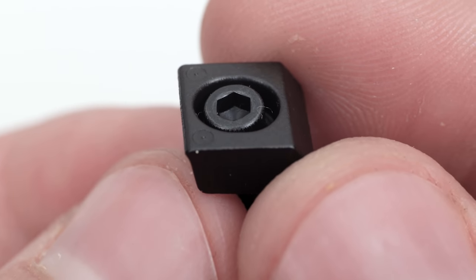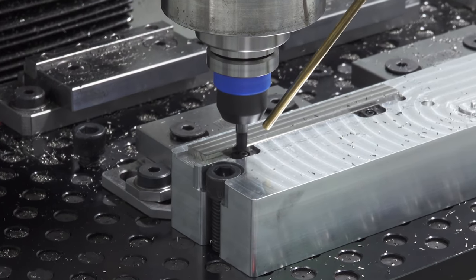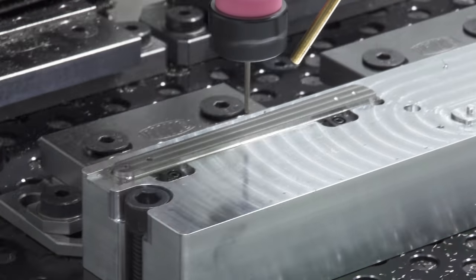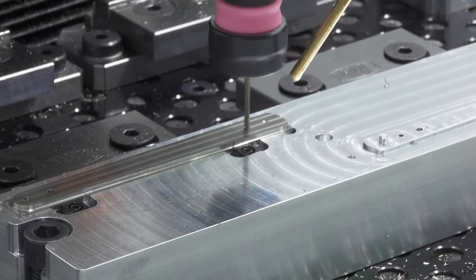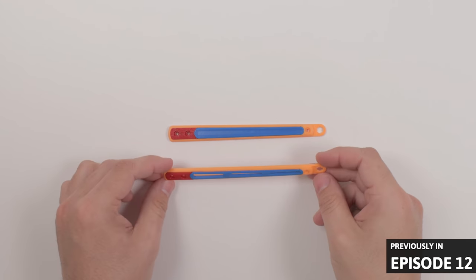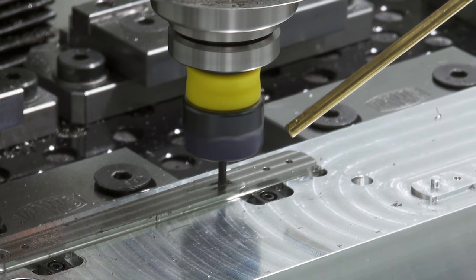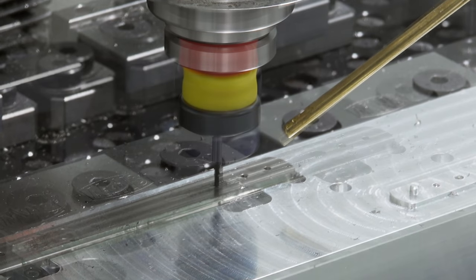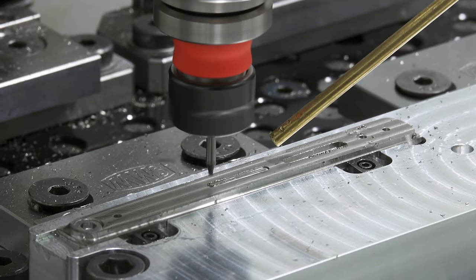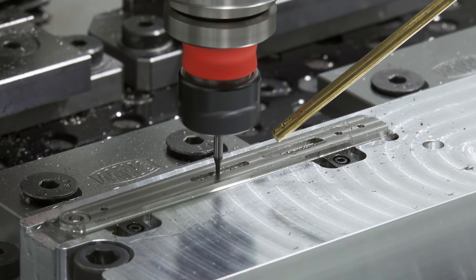I haven't used this small of pitbulls before, so I was a little bit worried about the stock slipping, but it seems like it was no problem. In my last video, I came up with a design that allows for the option of slots in the handles. I felt like using a ramping contour would be faster than an adaptive toolpath in the slots. Maybe that was too big a step down — let's try again.